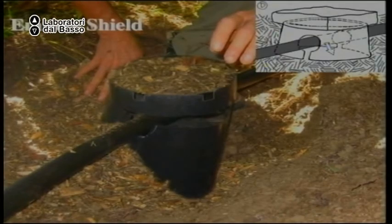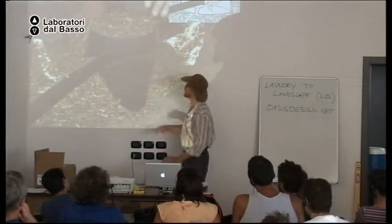In California, you have to have your emitters, your outlets, covered. But interestingly, right across the border in Arizona, you don't. And both systems work. Okay. So here, if we had the hole, you can take a planter pot, put it upside down on top of the hole, and then it's legal in California. Okay? But in Arizona, you don't need this.